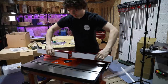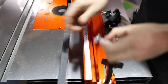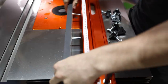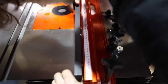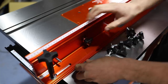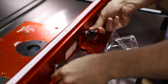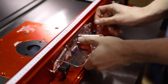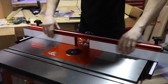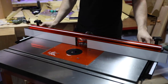Then you've got the sliding fences that fit in here — you just need to get the T-bolts to attach to the back. Unscrew one of the bolts from the knobs, that goes through the back of the fence. Get a washer on there and get the knob locked in place. To fit the dust extraction shroud, just loosen these ones off a bit, pull the washers back and simply feed it in behind them and lock it down. By loosening all those wheels on the back you can pull the fences apart to whatever width you want, and you get really solid locking along the whole length once you lock all six of these down.